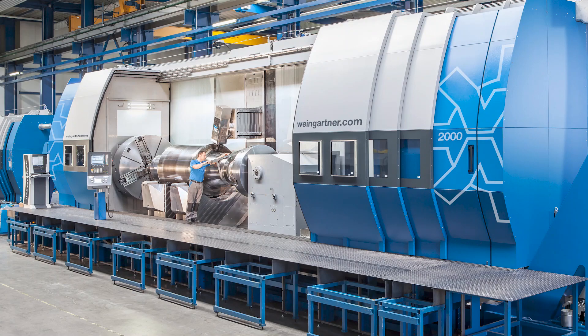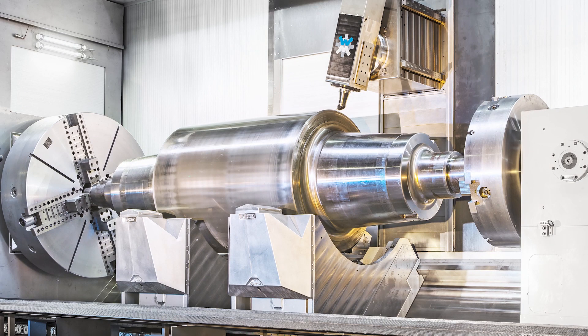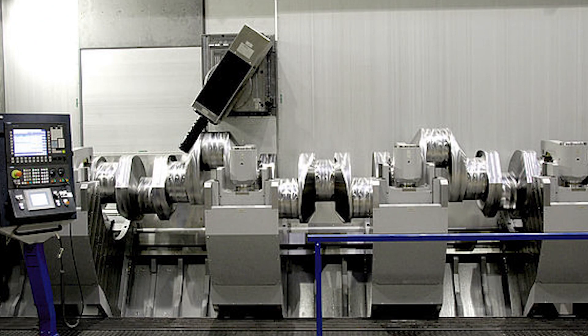What about the actual size of the machine? These railway wheels are quite big, but can you go bigger? Absolutely — the MPMC can go up to a two-metre chuck, as you can see here. We can take up to 80 tons in weight and 15 metres in length. By rights, these wheels are a fairly small item for a Weingartner.